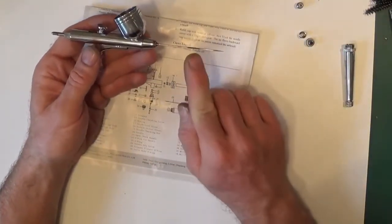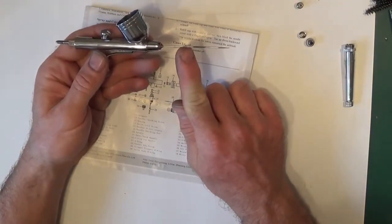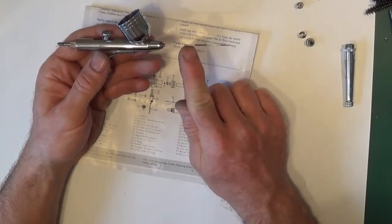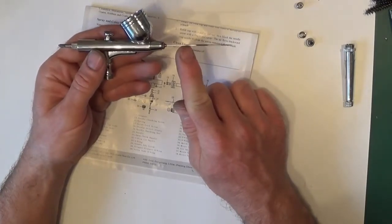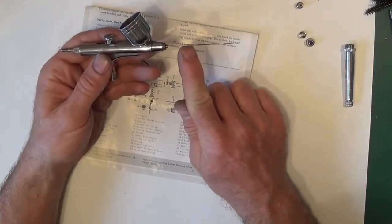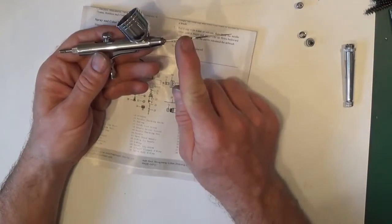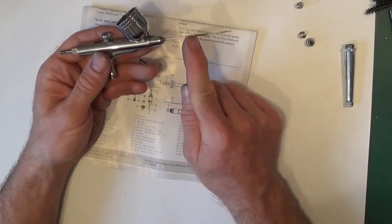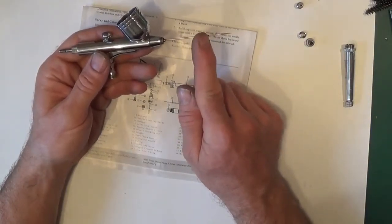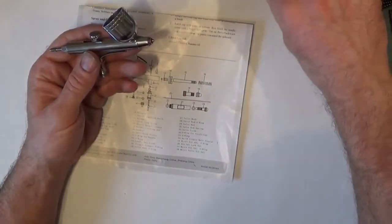Now if you look, you can actually see the build-up, that's obviously where the bush runs normally. Definitely not a leaking bush, there's no paint that side. That's just shine from where it's been going backwards and forwards. There's the paint, and obviously with the bush here, if you pull it through the rear, it's quite rough there, it will damage the bush, so take it out the front. I know it takes longer, but in the long run it's worth it.